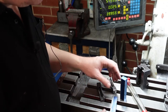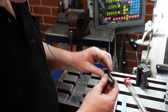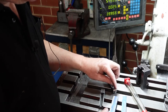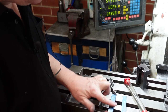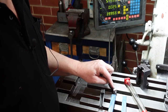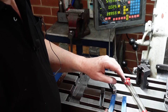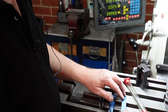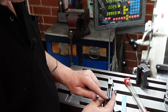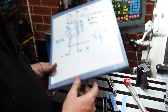One of these I'm going to make up as a quarter inch holder, so I'm going to drill that hole. The other one I'm going to be filing, so I'll machine that back and put some clearance in there so I can get in and file that hole easily. If you're doing something with a broach it's easier to drill the hole, put the broach in, then machine the material off. If you're using a file it's probably easier to machine the material off then put the hole in — it's a question of proportions.